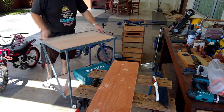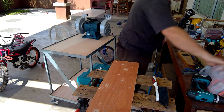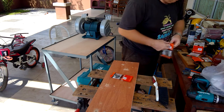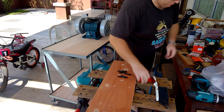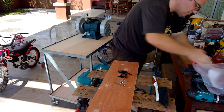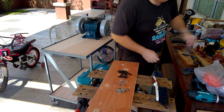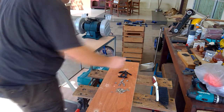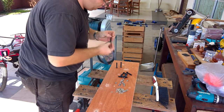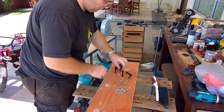The original shield was also a handheld one, meaning I only had one hand for the work piece, so having a helmet with a face shield like I would normally have at the lathe made starting out much easier. I would definitely recommend to any beginner going out and paying for an auto-darkening helmet — there are some cheap ones out there that are perfectly fine to use. The welder I bought was an iWeld 200di, a small portable inverter type that allows for both MIG and stick welding, and you can swap the electrodes between positive and negative to allow for flux core wire as well as normal MIG wire.